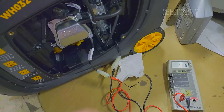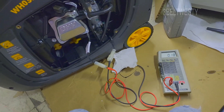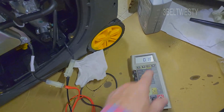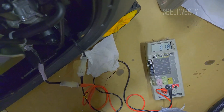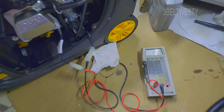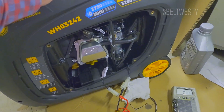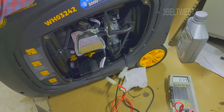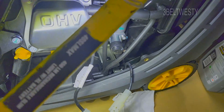You always leave this on, so I was wondering: if you leave it on half a year, a year... I went through the math, and at about 0.2 milliamps, after 8,700 hours — whatever it is in a year — it'd draw the battery down about 1.7 ampere hours. It's a 5 ampere hour battery that's kind of buried down inside there.